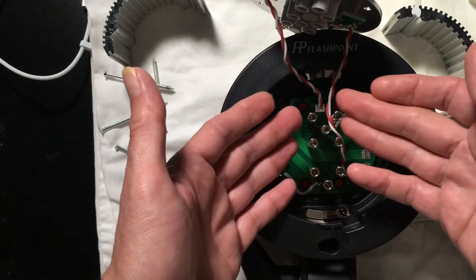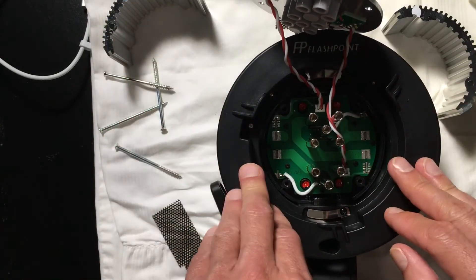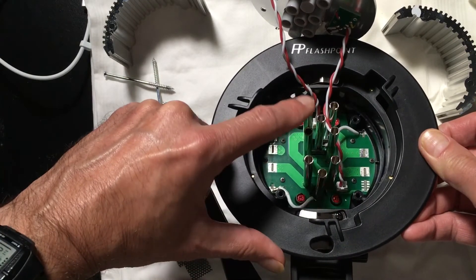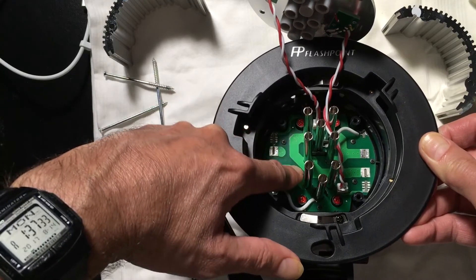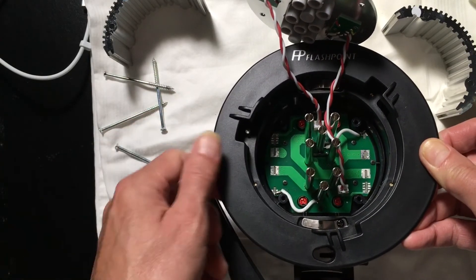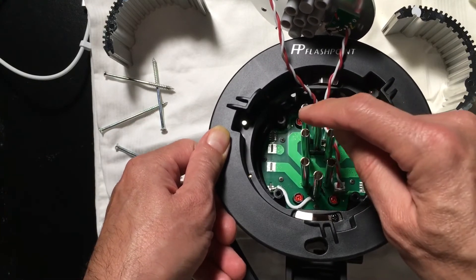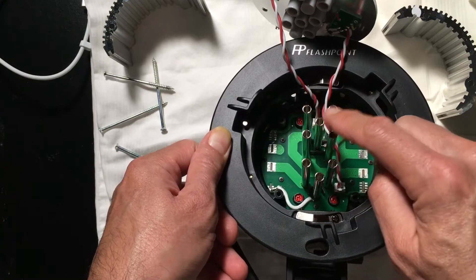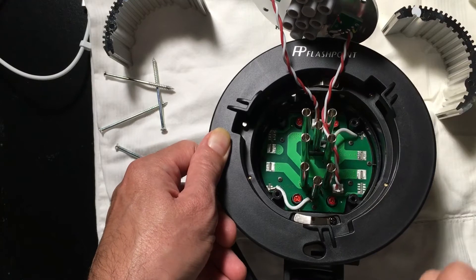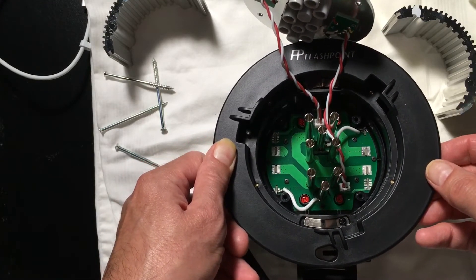So it's understandable they're not allowing that to happen. What they've done instead is to simply allow you to use that standard bulb either in position one, two, or in the center — which is still tied to position one. You can actually see how they've accomplished that: this pin here, which is on this trace, and this pin here are electrically connected, as are the pins here and here. This allows that bulb to be oriented at the top position or in the center position, and still have that single AD200 bulb fire off effectively.